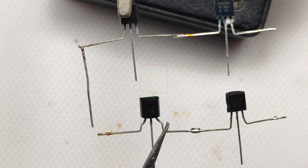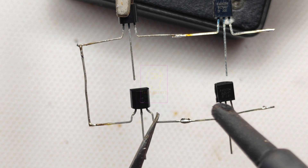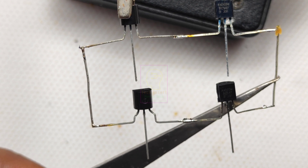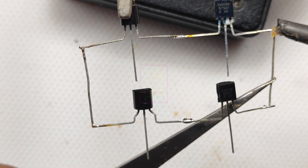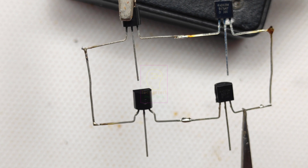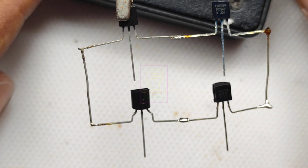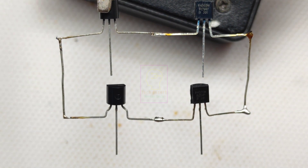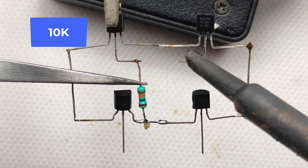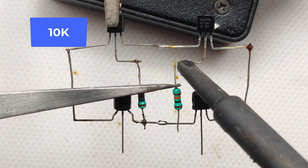The circuit is so simple that it contains four transistors, four resistors, and two LDRs. The motor we have used is a geared motor — typically 5 RPM or 10 RPM will do the job perfectly. We should use a geared motor, otherwise the solar panels could not follow the sunlight because of the high speed. I have tested this circuit with a 12 volt 50 watt panel and it is working perfectly fine. The panel I am using in this video is 6 volt 160 milliampere, which is a small one. I have used the same geared motor for the 50 watt panel. I have tried to make the assembling so simple so that anyone can assemble this. Please do not skip this video and do not forget to like and share.